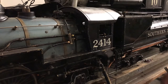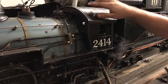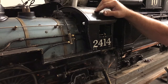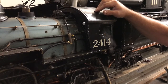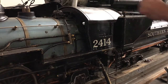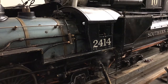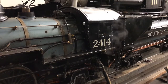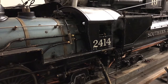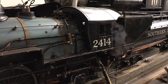I'd like to point out that I've got a pretty nasty steam leak in my steam valve and steam is leaking through the injector constantly, so you just saw it pick up while the injector body was excessively hot. It still did it from three feet and it's putting in beautifully. Overflow is running completely dry. I'm holding about 80 PSI and pressure is not dropping any time fast.